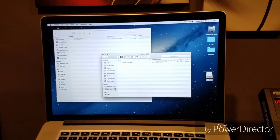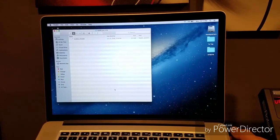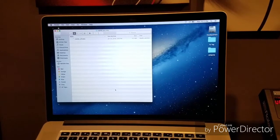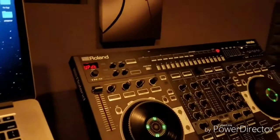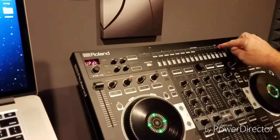When you are there, double click your DJ808 drive and you will drag and drop the BIN file into the DJ808 drive. Once that is complete, eject your drive the proper way for your operating system.